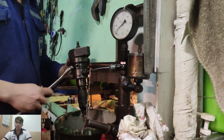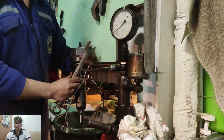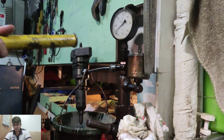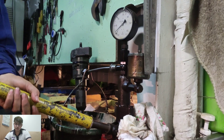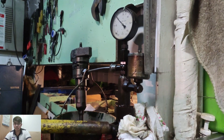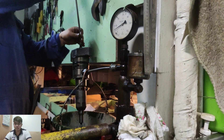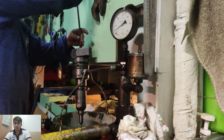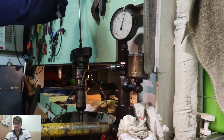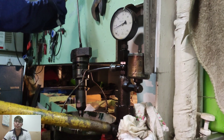Now we are going to test the pressure of the fuel injection valve. Using our 24 wrench, let's attach the tester to the fuel injection valve. Using this lever, we can operate the tester. As you can see, the pressure is not enough. To adjust the pressure of the fuel injector, we have to increase it by turning the fuel pressure-regulating valve clockwise — there, it increases, but it's too much. The manual says that operating the tester slowly will suit a leakage test of the nozzle.